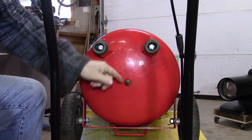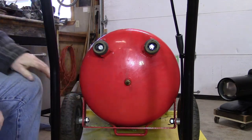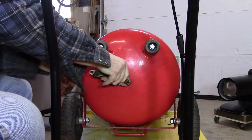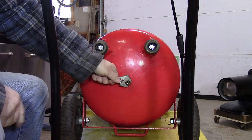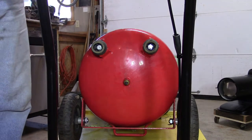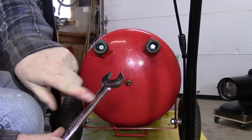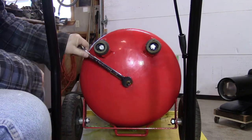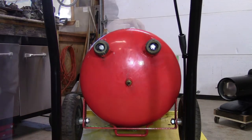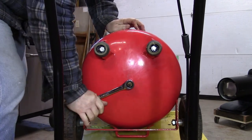I've got my compressor tipped over and I loosened the drain valve. There's a little bit of water coming out but not much, and no air pressure blowing out of it. I'm going to try and take this fitting right out because I'm afraid the inside of the tank is filled with sludge. It's nice to read the size on your tools very easily because I marked them with red paint — but I still need to make several trips to get the right size. There she comes.